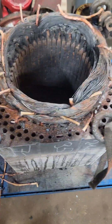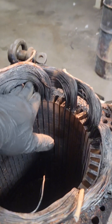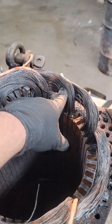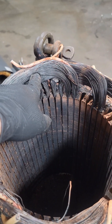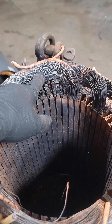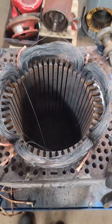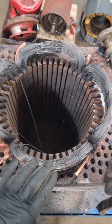Once the connection's been identified, I just start cutting all those off so they're out of my way. To give an idea of how this works: we turn this set of coils on, then turn it off; turn this set on, then off; then this set on and off — then we turn the first set back on, but because it's AC we flip the polarity, it becomes a different pole, and we ride that sine wave. This creates a rotating magnetic field. Here are your four poles of one phase.